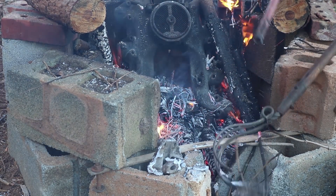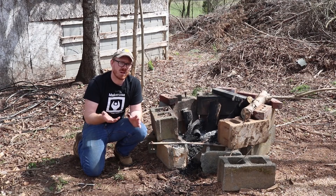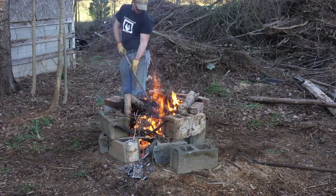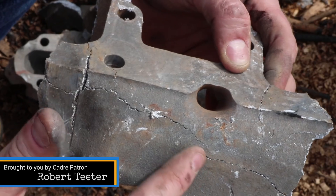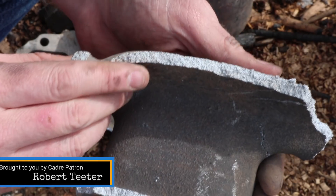The idea with this technique is to get parts like the intake manifold up to a temperature just a little bit below their melting point. That's called hot shortness, and what happens at that temperature is the grain boundaries are subject to cracking when exposed to stresses.